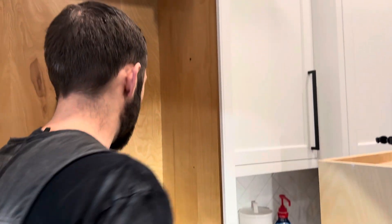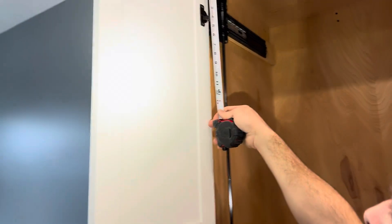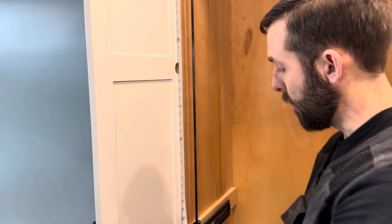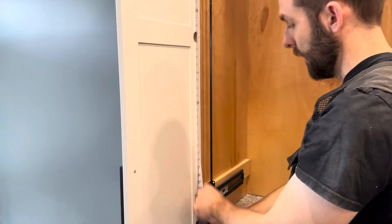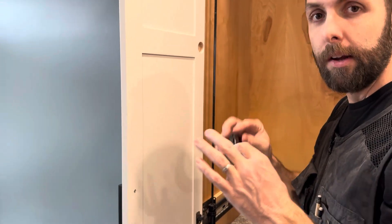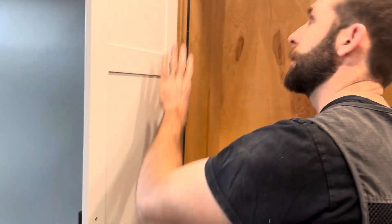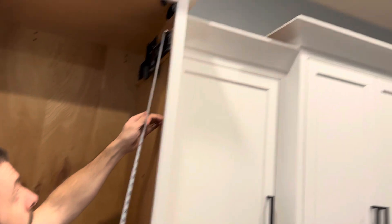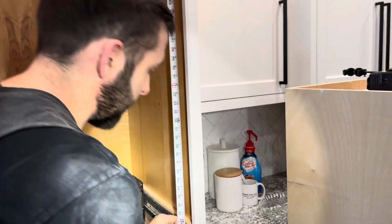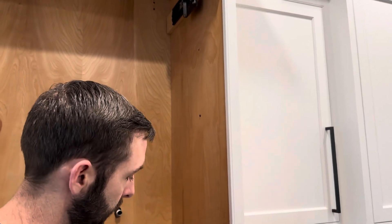So we're going back to the start. To verify this, we're looking at the hinges and measuring the center-to-center. The secret trick is if you need center-to-center, you can also measure edge-to-edge as long as you're measuring top edge to top edge — and that was 48 and 9/16ths. With adjustment we could be within a 16th total, so 32nd plus or minus. I took that dimension and verified that the top of our track and the top of this track is at 48 and 9/16ths, which means the center-to-center is the same.